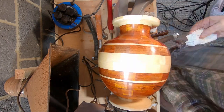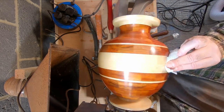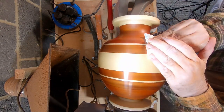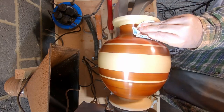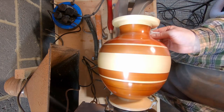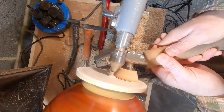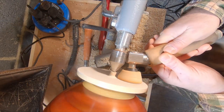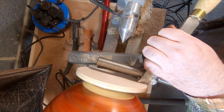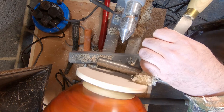Up next to finish off is Hampshire Sheen Micro Crystalline Wax — two coats, polished off to seal the surface. To finish, I've turned it round so I can remove the tenon. Most has already gone with just a bit in the middle to go. I sanded as much as I could and as if by magic the rest disappears, only leaving me to level the base so it sits without wobbling. A bit of sealer and polish and it's done.